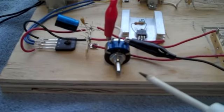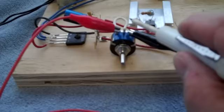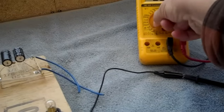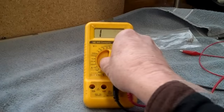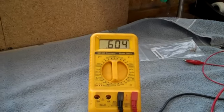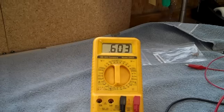They may very well turn out to be the same. I've got it disconnected — I just went ahead and unsoldered this one wire right here off one end, and I've got the two leads connected. Let's find out if we still have 172. Nothing on the 200 scale. Let's check the next scale. 603 ohms. That's a whole lot of difference from 172.